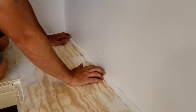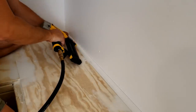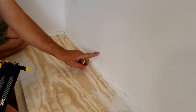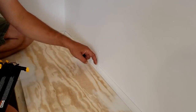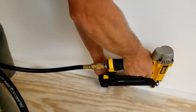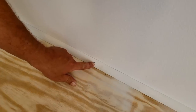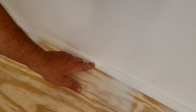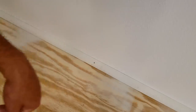I'm no pro when it comes to finished carpentry, but generally what I like to do is put all the trim in place and then nail it all together at the end. I'm looking for a stud — I can see a nail where the drywall was screwed into the stud, and you can use a stud finder too. I can also just go down into my plywood. What you're left with is these little holes from the brads, but once we paint over this, even with just primer or regular paint, it'll fill these in. You can also take white caulk and just dab a little bit across that to cover it.